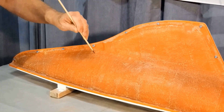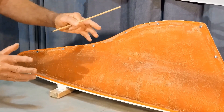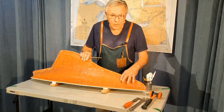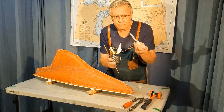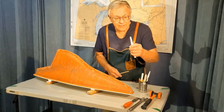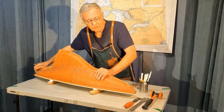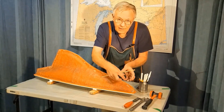When the two mold halves are bolted together inside, I could have two laid-up hulls and then attach them together very accurately. So now we're at the stage where we can try to release the two halves of the mold from the plug. I'm going to use soft plastic sculpting tools to try to release the sides, but I have to have some kind of a gap where I can start and insert just one end somewhere here. This layup has a reverse transom, so the only way I can release these sides is to go out, up, and back.